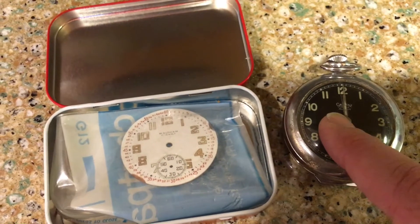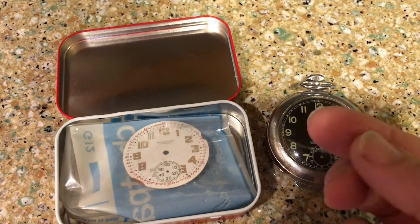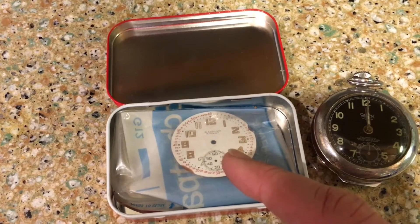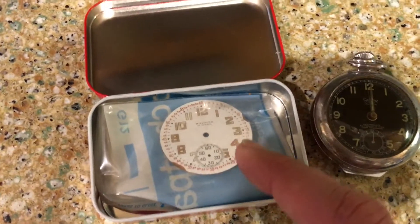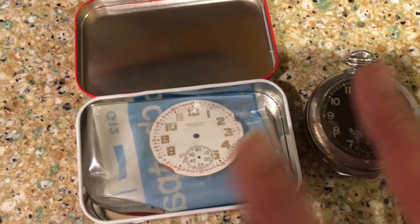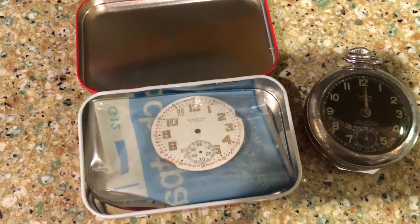Because this has been taken out of the watch, that dust can spread around, and it is giving off a lot of alpha radiation from the radium. Some of that can't get through the glass, which is why levels on the intact watch are probably a little lower. Even the alpha radiation has trouble getting through my skin from a distance — it's not great at that. However, if this dust gets loose and gets into your lungs, it is extremely dangerous. This was loose in with the watch parts my wife had bought off eBay, and some of the dust had gotten over all kinds of parts in the kit. The person doing the watch repair likely had radium all over their hands and probably inhaled some — which is a pretty dangerous situation.